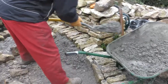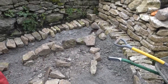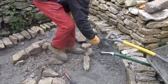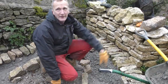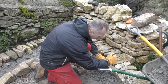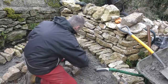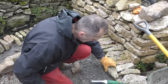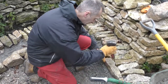We've got a bit of mix in there — just grab the trowel and level it out a little bit. It all depends on what you've got to lay. This one will go in there — at the moment if I put that in it would be too low. I'll put that in there just to give me a guide, pick a bit more mix, drop that on top, and balance it into the rest.